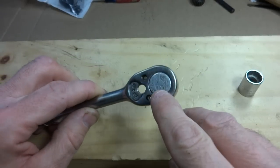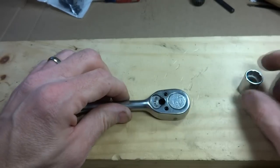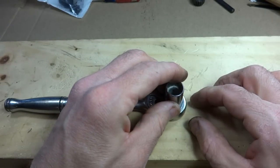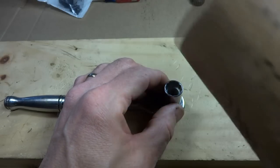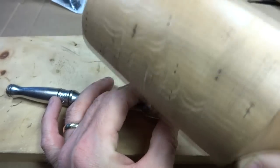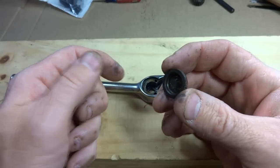The next thing I want to do is remove this little name plate here, and then there's a little bushing that fits back in there. That's pressed in, so I'm going to knock that out. I have a 13mm socket — it's basically just a little bit smaller than the name plate. I'll set that on there and tap this down with a wooden mallet. And there's the name plate and the bushing out.